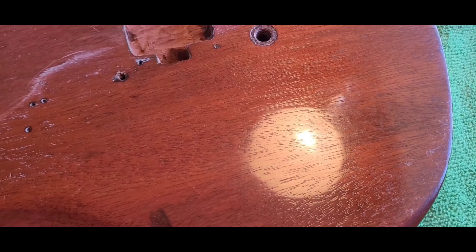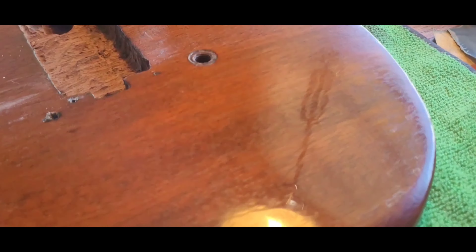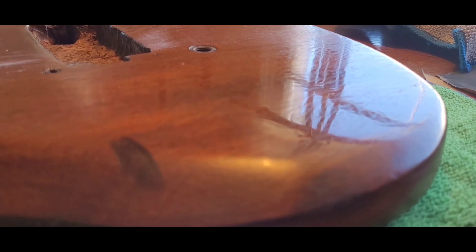We went ahead and used some 1500 and tested it on a small part of the bass, right up where your arm rests. Honestly, I did not expect any reflectivity. Walnut is a weird finish on Gibsons — when it goes dull it looks dead, there is no reflectivity, and there are parts of this bass where it's not even clear if you're looking at finish or bare wood, because walnut when severely oxidized looks and feels like bare wood. But right there we've got a substantial amount of finish left with enough thickness to hit it hard with 1500 and not burn through.